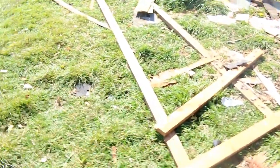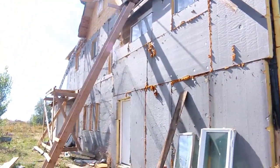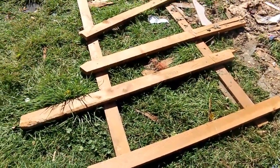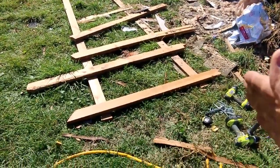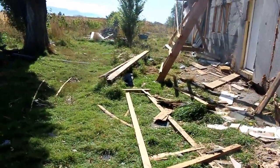I've got some 16-foot 2x4s that actually came out of this house as we were demoing and redoing it, and a whole bunch of other scraps. To make it really sturdy, I'm tapering it — making it extra wide at the bottom, as you can see, and then tapering it to a normal ladder width at the top.